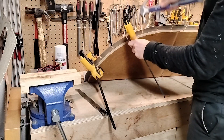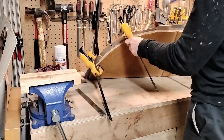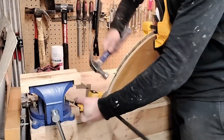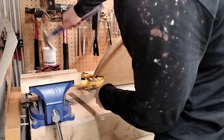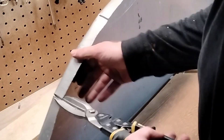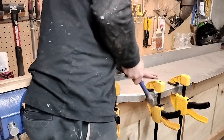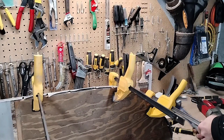This part takes a lot of hammering. I found it really useful to hold on to those clamps — as you're hammering you want to bend down each tab gradually, not having one get way more bent than its neighbor. This is a good example of why you want to bend them all down gradually together. You'll find that once they get started bending they bend more and more easily. I recommend checking the position of your wooden template periodically to make sure it hasn't moved from all the hammering. I think that curve is looking pretty good — that gap is just enough. Now these tabs don't have any overlapping metal. Here I've used another board to stretch across the straight part of the middle and flip the template around to get the other side.